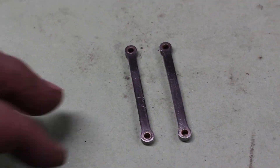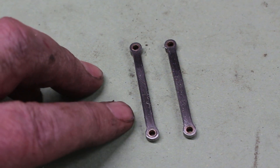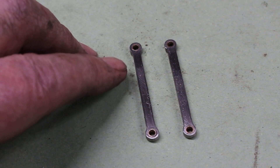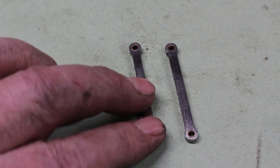Okay, that's them done. I've given them a polish with some 280 emery cloth. I may polish them a bit more later on, but actually I quite like this satin finish that you get with the emery cloth. I've really enjoyed making these, doing it all by hand for a change.